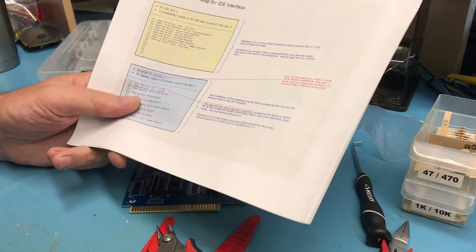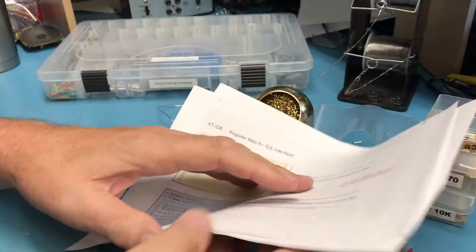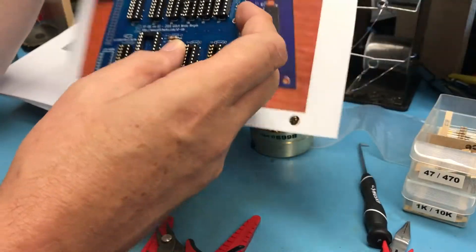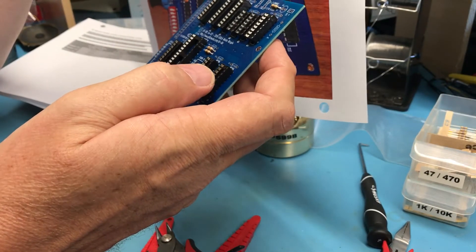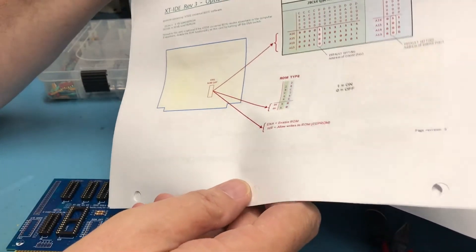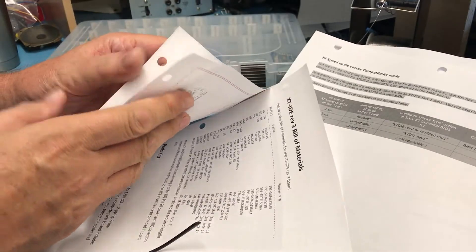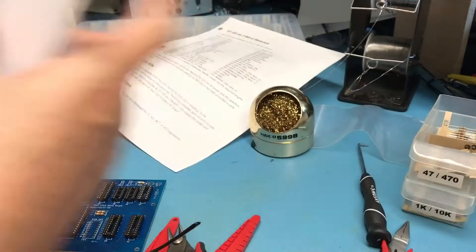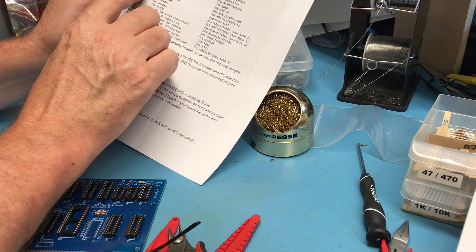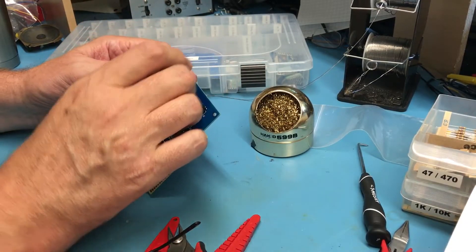So I did a bit of digging online and found some documents: the register map, a picture of a completed board — and looking at that picture I missed something. This version shows two resistors over here; I've missed a 470-ohm resistor. Also found boot ROM locations — I'm going to put the boot ROM on the card since I don't have a spot on the actual motherboard. The bill of materials calls for resistor networks R1 and RP12 at 10K — so they're just pull-up resistors. Anything close to 10K would work, but I need to put in that missing 470-ohm.